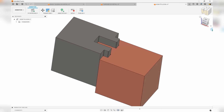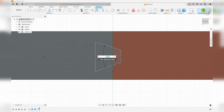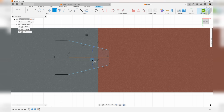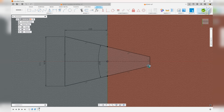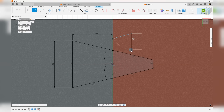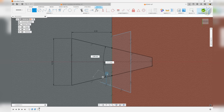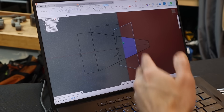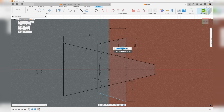What we need is a way to lock those flanking pieces from coming apart. I'll start with a sketch from the very bottom and create a simple dovetail shape with an included angle of 30 degrees. The dovetail in the last video was kept pretty small, but here I think we can increase the size — maybe 10.5 millimeters wide and 8 millimeters deep — and we need to make sure it's centered. For the other side we'll do basically the same shape but in three parts, extending just two millimeters beyond the intersection of the two rail pieces. These pieces need to be between three and four millimeters, so I'll go with four millimeters out, and again the angle is 30 degrees.